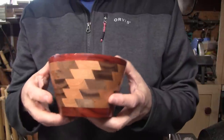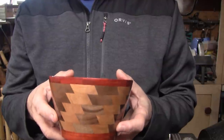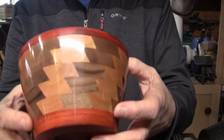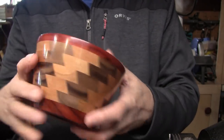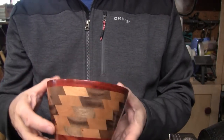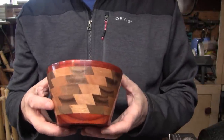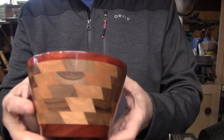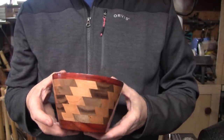I used about four, maybe five coats of deft lacquer sprayed on it and I actually didn't sand it until the end — it went on so nice. I sanded it with 400 grit sandpaper, then used the white Scotch Brite, and I used AXA Abrasive and Polish — that's why we have such a lovely shine and all that chatoyance really shows up. I've been wanting to try segments with an angled joint for the longest time and I am sure glad I did, and I am sure glad I picked the wood that I did — look at the chatoyance, it's just amazing. It's got walnut and cherry for the segments, and padauk on the top and bottom. These segments were tricky to glue together and tricky to cut, so if you feel something like this is outside of your capabilities, please don't even try it — just make them straight up and down and you'll make a beautiful bowl just like this. It would look just as well straight up and down — it's just something I wanted to try and I did, and I'm really happy with how it turned out.